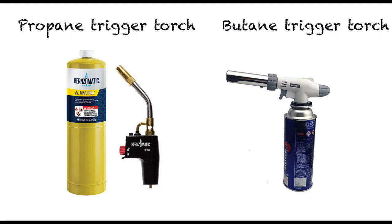You can do a lot with forging and sawing. Cold connections, you can do a ton of things. Rivets, tabs, there are tons of ways to not have to solder. The only thing I finally had to go to a torch for was annealing, when I was forming metal and it got so work hardened I couldn't bend it anymore. Even then, a triggered propane torch that you can get from the hardware store, I still solder with that and still anneal with that occasionally.